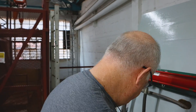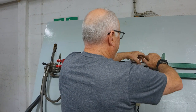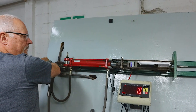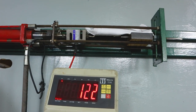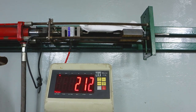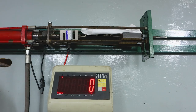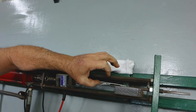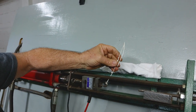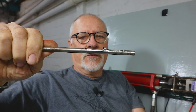Let's try number three. Test number three — let's see how this one goes. 180 — plenty good enough. Took the others up to 250; I'm going to keep going with this one. And there she broke — well, something broke. Double Dyneema snapped. No way are we ever going to put that sort of load onto that fin. Looking at it now — exactly the same as the other two, no distortion. So they're easily handling 250 kilos.